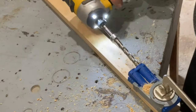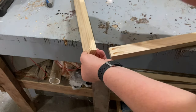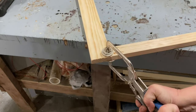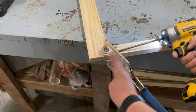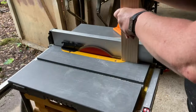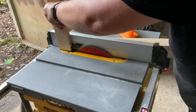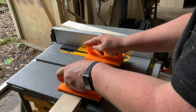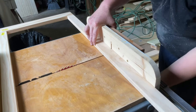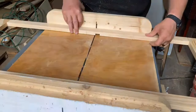To assemble the door frames, I'm using butt joints with pocket holes, but I'm also going to add a center brace with a half lap joint. I know this isn't the best way to make a cross cut, but I broke my miter gauge. It's a very small cut and I'll be standing off to the side, safely out of the way of any kickback.